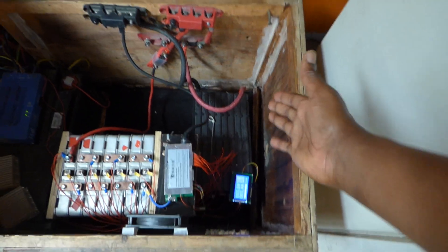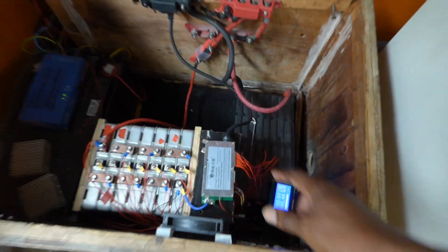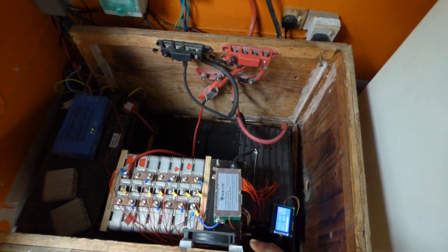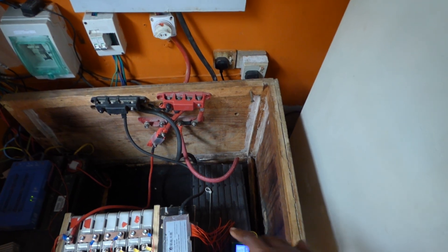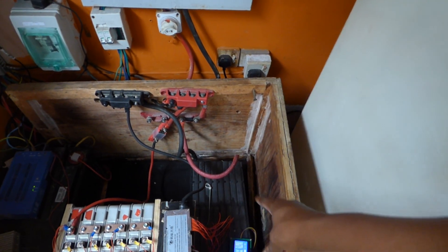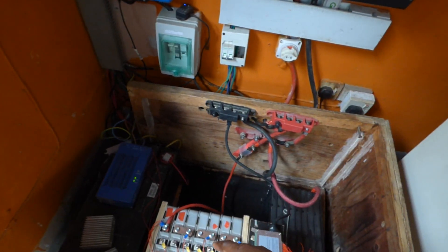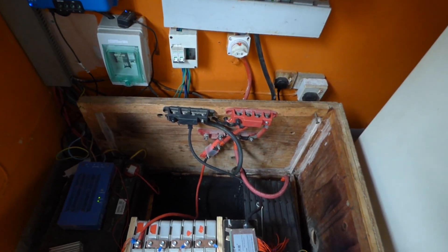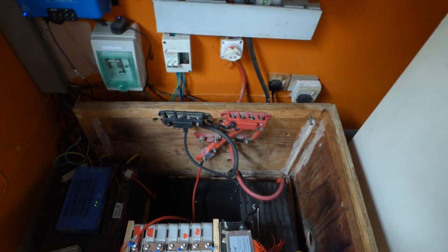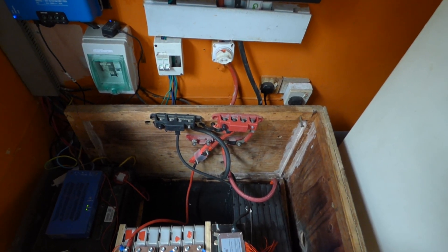What I'm doing differently is I have the LG pack running at a much higher voltage — up to 63V — while the Nissan Leaf is only up to 58.8V. Anything above that it will stop charging. Everything is going through the BMS on the Nissan Leaf side; the LG is going directly for now. Eventually I'll replicate the same BMS connection for the LG batteries. The minimum for the LG is 48V versus 42V for the Nissan Leaf, and the maximum is 63V versus 58V, so running them together means neither pack will be used to its full capacity.